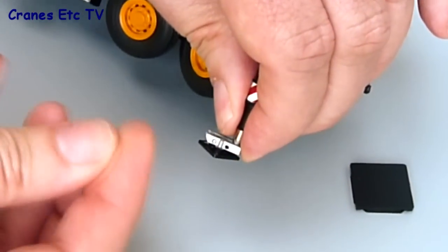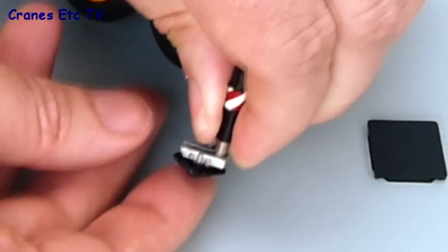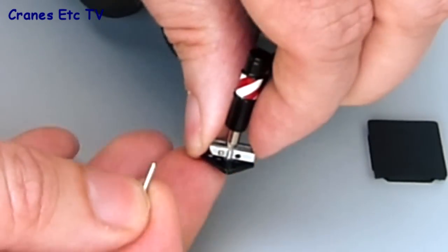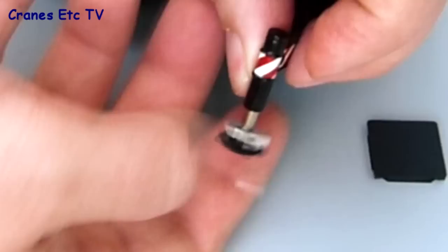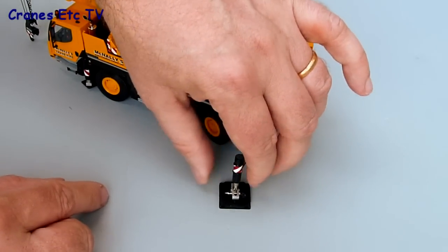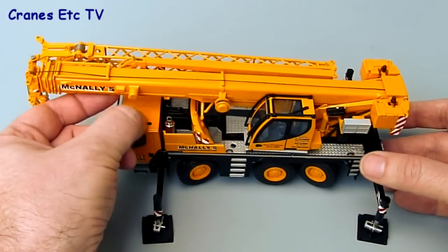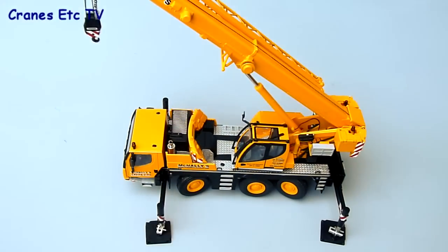You get four small pins which can be used to pin the pads into place in the offset position to secure them, and when setting the crane up as if it's being used, you slide the pad over and insert the pin. But a word of warning: the pins are very loose within the pads and they're very easy to drop and lose on the floor. With all the outriggers down on the support pads, unhitching the hook from the front makes it easy to raise the boom — the boom lift cylinder is not very stiff on this model.